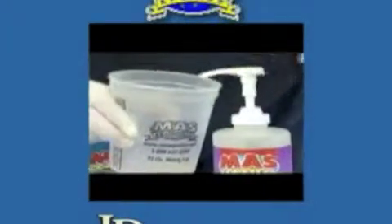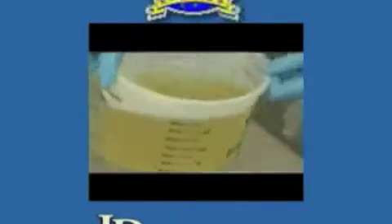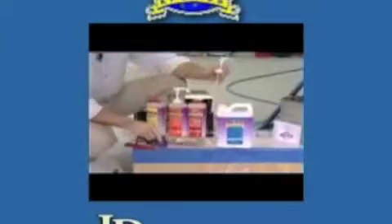JB, your company makes epoxy resins, and this is what you generally use when talking about a resin-infused part. You actually make a special type of resin for infusion — can you tell us about it? Sure. We design specialty resins for infusion because infusion resins have to be very low in viscosity, very thin, so they can flow through that fabric. We control the cure cycle because here in Key West it's pretty hot, so we use a slower hardener designed for here. If we were in Portland, Maine, or Seattle, we'd make a faster hardener for those guys. We customize it because we have to have that thinner resin to flow through the fabric.